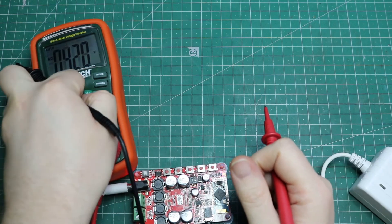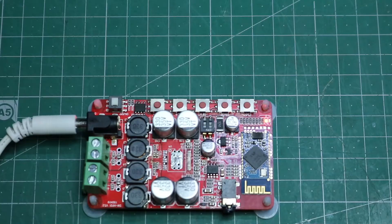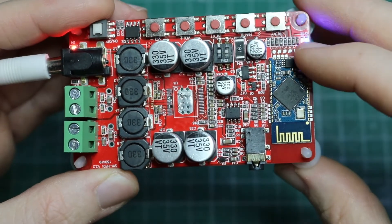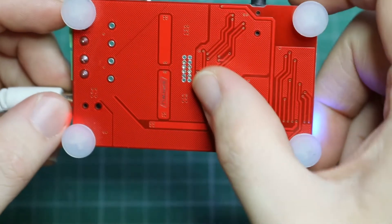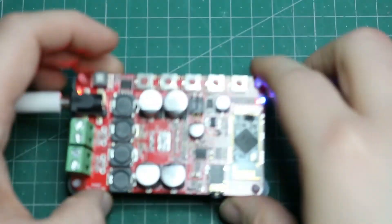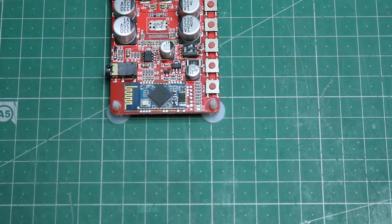So what's happened to this? What I think has happened is possibly the chip got too hot and shorted itself internally — I've seen some on eBay with heat sinks. It has a bit of heat sinking through the board, but maybe not enough. So it's broken.